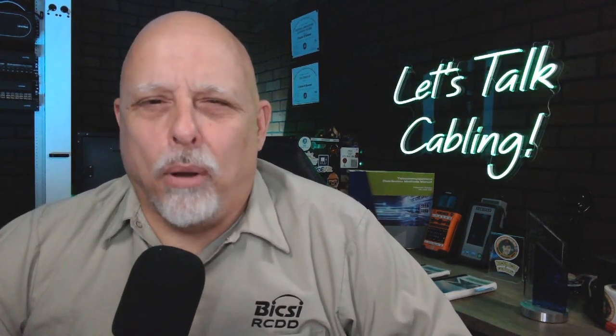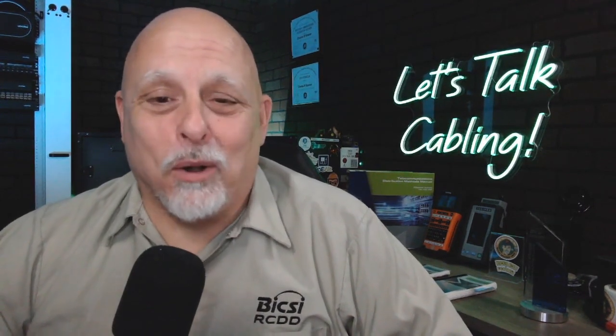One of my followers is a fiber technician who does fiber to the home. I think he's in Poland, if I remember right. His name is Shutsky. And he's always terminating fiber outside in the cold. Almost every video I see him doing it. So if you're in cold weather, you need to be in an enclosed environment, either a canopy, or if it's real windy outside, you're going to have sides on that canopy as well. But fiber does not like cold weather. So you want to keep the area up in temperature.